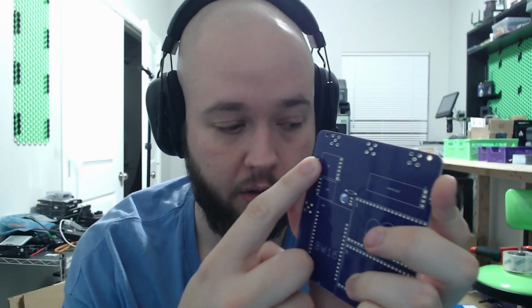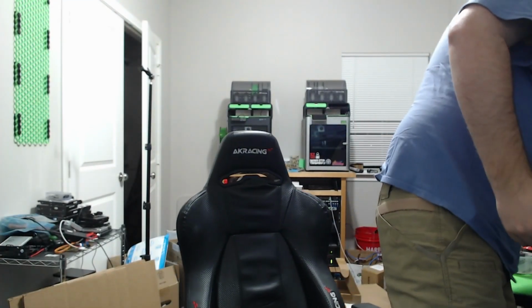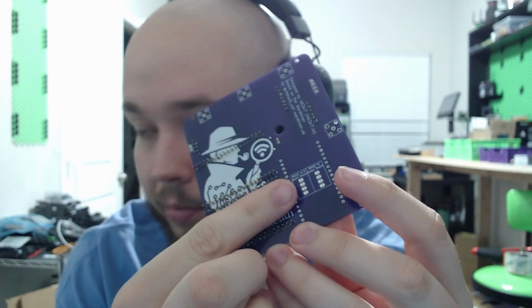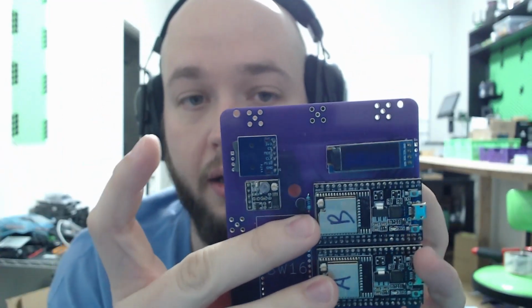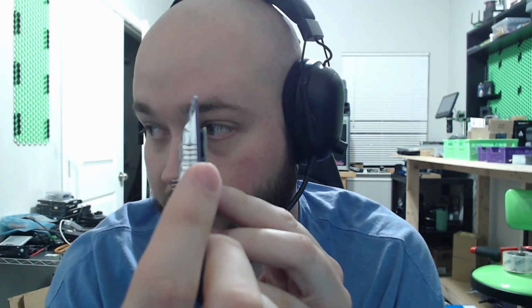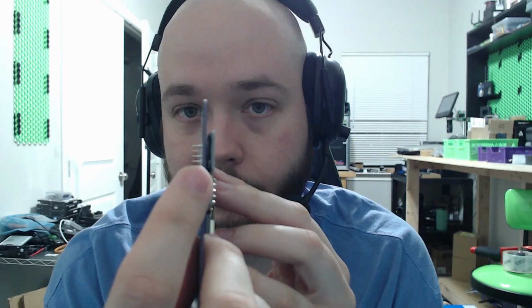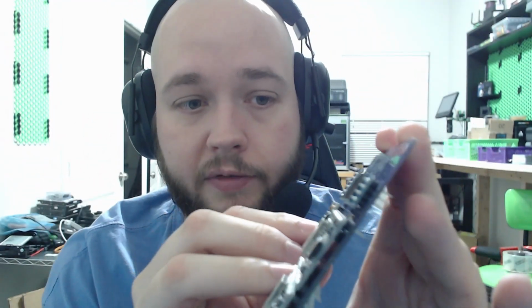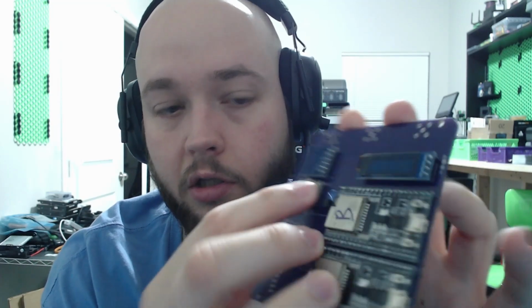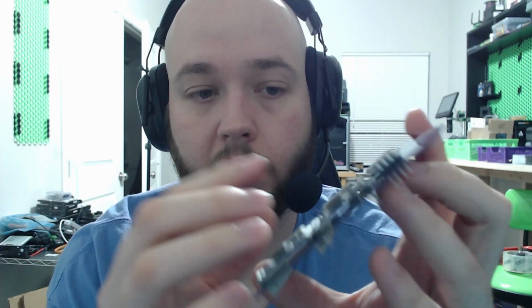So you'll solder them all together by putting everything where it goes. Watch the SD card reader. Let me get one that I have already soldered on. So this is an original Signal Sleuth. This isn't the version 1.1. Another thing that's different is we don't have to jump all these pads. But watch the SD card reader. It is mounted upside down. You have the PCB flat side that'll be facing out. So the actual shield for the micro SD card is sandwiched between the two PCBs. Everything else should be pretty self-explanatory. On the ESPs, BW16, and the GPS, you all want the antenna UFL connectors facing out so you can connect to them. Again, everything else for the most part is the same.